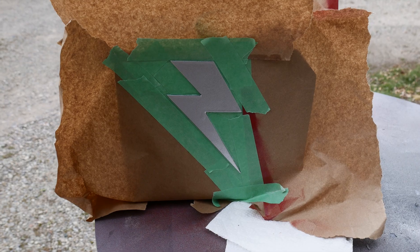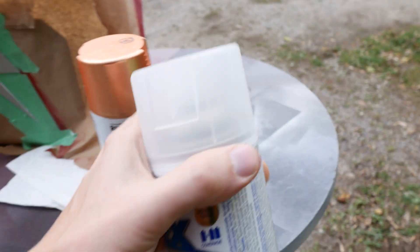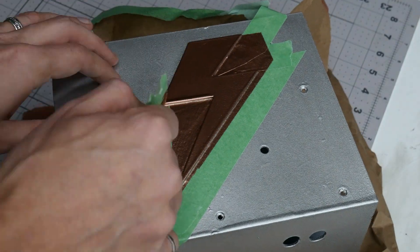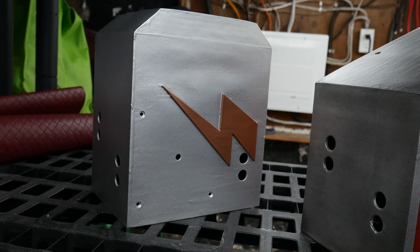When painting, you'll also come across pieces that you're going to need to mask off. Oftentimes, you'll get bleed paint under the tape itself. The way I fix this is by getting some clear coat and spray painting the area I want to do really quick, letting that cure, and then spray painting my final metal coat on top of that. Look at how crisp those lines are on this lightning bolt. So all the metal paint was applied, I let it cure for another day, and then I applied another layer of matte clear coat over everything.